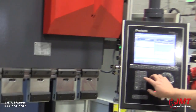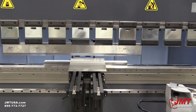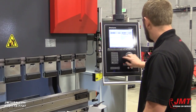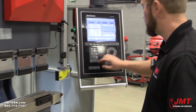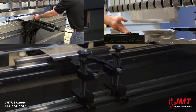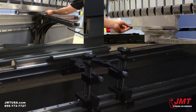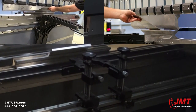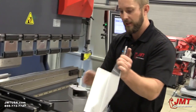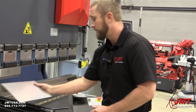Our back gauge can be set manually. Setting it to 10 inches and pressing enter, the back gauge simply goes to 10 inches. To show how the retract works: back gauge at 3 inches with a 2-inch retract. You can see when the press brake has pressure and clamps the material, the back gauge moves out of the way. That's important — especially on bigger parts — because the back gauge can push against the material, potentially damaging both the part and the back gauge. So it's important to use our retract.